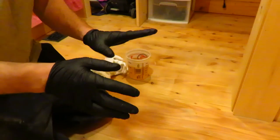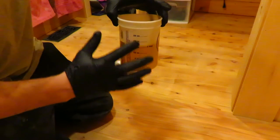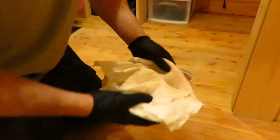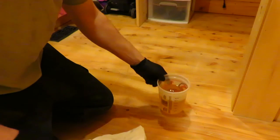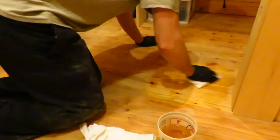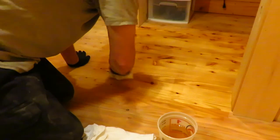I just wear rubber gloves when I'm doing this. I use a mixing cup that has ounces on the side so I can put 12 ounces in of tung oil and 10 ounces of mineral spirits. You're going to want two clean, dry rags — I found that t-shirt material ones work best because they don't leave any lint behind. If you've got a big surface, when I was doing the whole house, I was mopping it on, letting it sit, and then going back around and drying it off. For just the bathroom, I put a little bit on the rag and rub it on the floor generously. If I find any spots where it's absorbing really well, I'll go back and reapply.